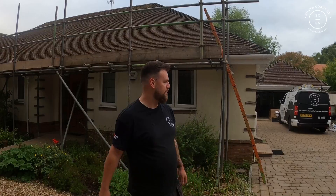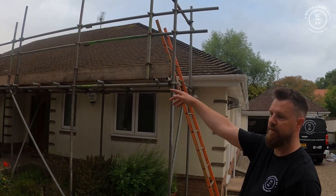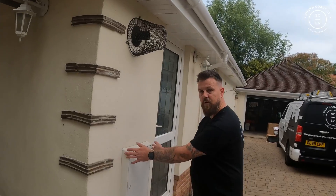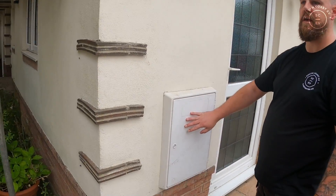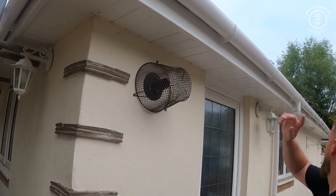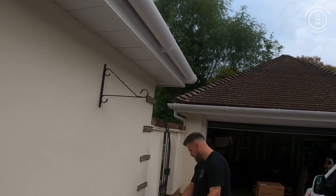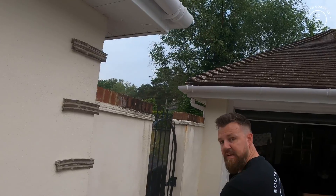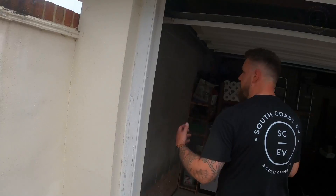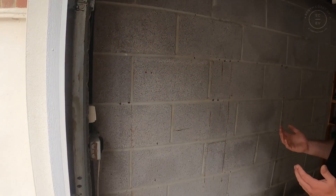So let's do a quick run-through of what we're here to do. We've got our scaffold here on the south facing system and southwest around the other side. We're going to have a fuse box with a 100 amp switch fuse isolator, taking a 16mm EV Ultra sub main up through the loft space, running all the way down. We'll lift a couple of rows of these paving slabs and dig a trench to get the cable in. We've done a schematic of how we want this to look, so we've got a diagram to follow — it's always easier if you're following something.